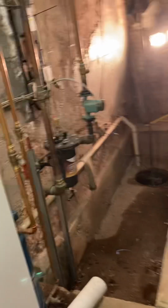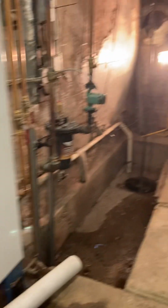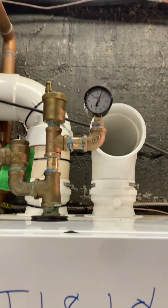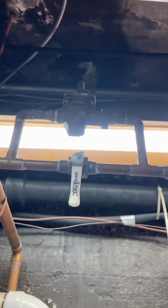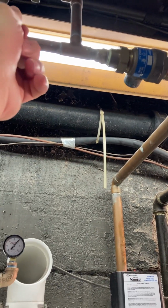I suspect that somewhere in this dungeon of pipes, we might have a slow leak on some of the old piping. And I don't know if we're going off on high limit because we're dropping off on pressure, and my automatic feeder could be stuck, right? I mean, I could open up and manually feed water into it, right?